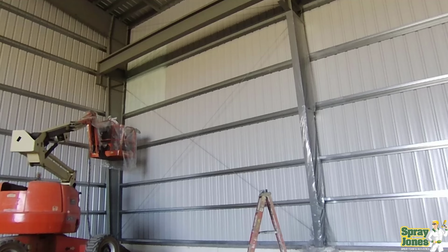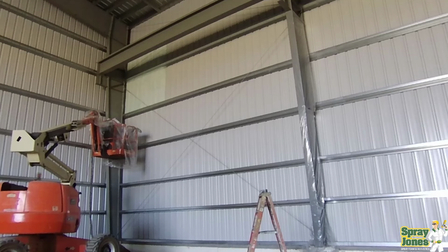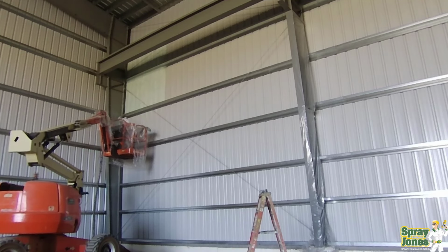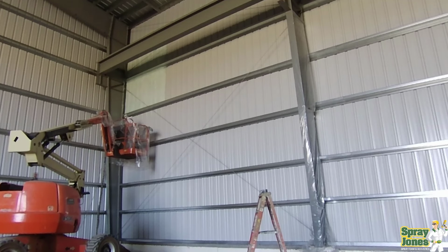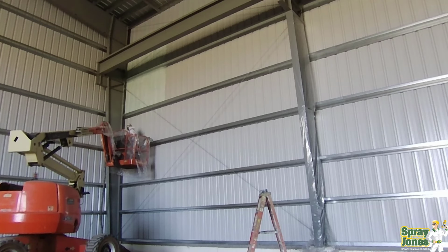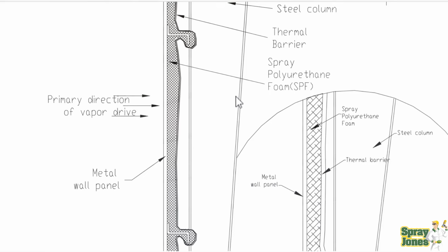But these can be very technically challenging areas if this is a 2 foot or even a 36 inch deep superstructure with flanges at the bottom, the flanges will cast you off from getting in there. It can be a very deep cavity to try and get spray foam back into there. So there's some very technical challenging areas we've had to overcome on large buildings, and you as sprayers have to overcome, and you have to think those through.